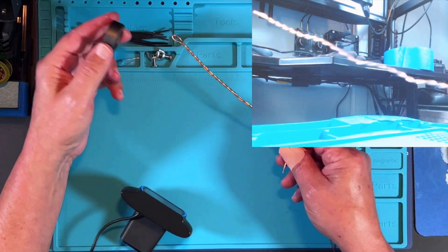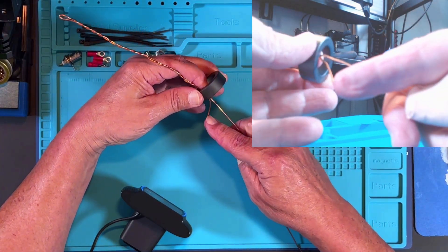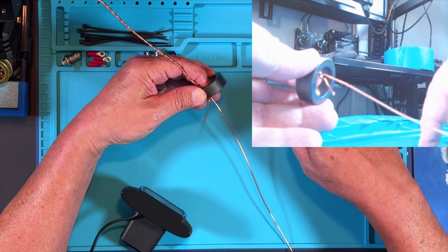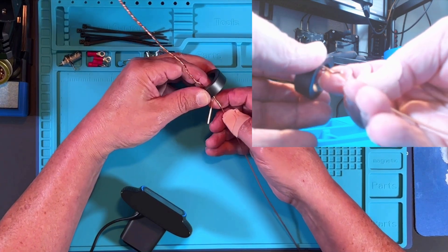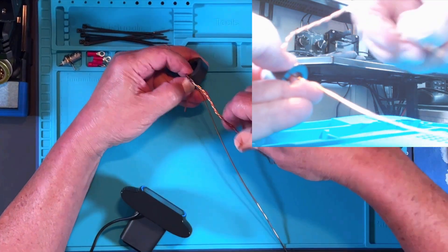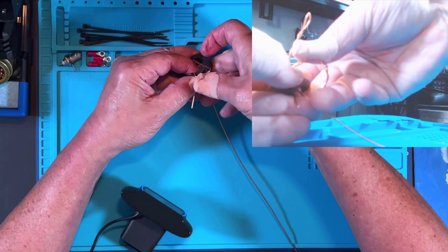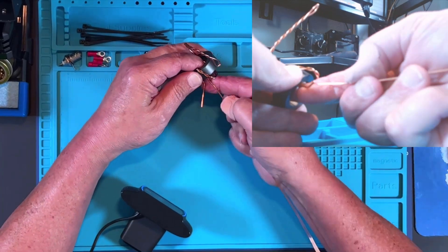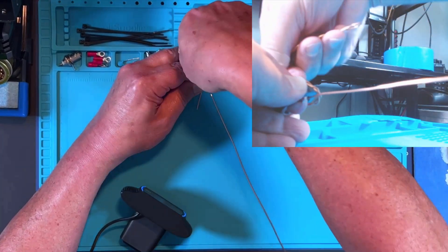Let me illustrate it. First, take your wire and put it through the center of the toroid. We're orienting the piece of wire that was an inch to inch and a half off to the left-hand side — left, middle, right — so off to the left-hand side. It will stay at the bottom of this toroid. Then we're going to bend the wire off to the right side. Here is going to be our first turn, and I'm going to automatically go right back up through the middle before I tighten over here.